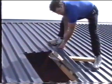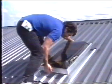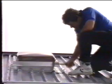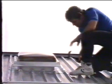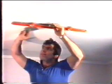Insert the Sky Dome and push it into place so the profile laps under the top and over the bottom edges, then nail it securely when you're sure it's where it should be. Clear Light makes it easy because there's no need to flash or seal any Sky Dome profile. Inside, plumb down from the dome and drill mark the corners.